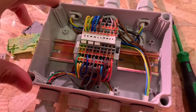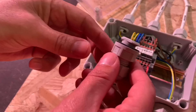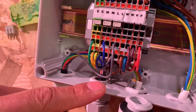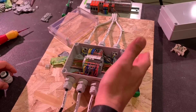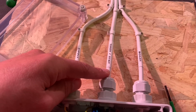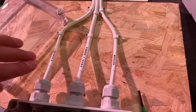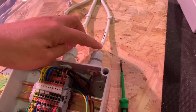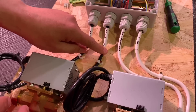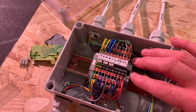This is an enclosure we've featured before from HiLac, and we've coupled that with some quick-fit cable glands — so no lock nut needed on the back, which creates a very minimal space requirement inside the box. We've got what you'd expect to see on an S-Plan: a power supply coming in, a five-core cable going to something like a Nest Heat Link — a combined thermostat, timer, and switch for the hot water. Supply out to the boiler to fire up the boiler, which also works with the pump. Cylinder heating stat and two zone valves for the hot water and heating system. Pretty much a standard S-Plan arrangement, but we're using the Top Job DIN rail connectors.